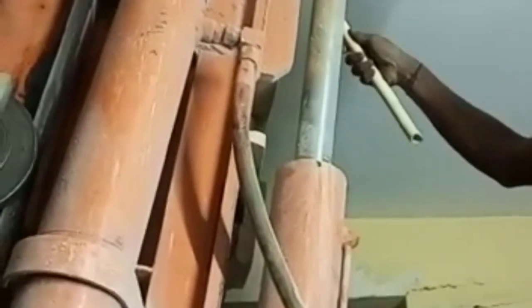See, tomorrow we are going to drill, and today itself we came to the site. We are setting everything. Actually, we require this much space. We need a height of 10 feet, 10.5 is better. See, the rig is this much bigger. We require a place where two lorries can stand outside the gate. We came one day before, and now we are just checking the point before starting the work.